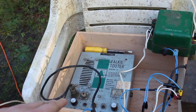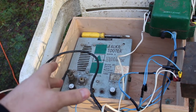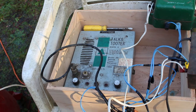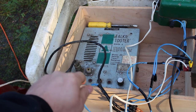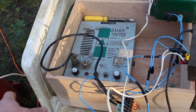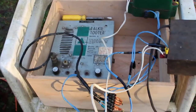And generally this yarder box is mounted just somewhere out of the way. In one of the yarders I ran, it was above me, mounted to a plywood board, had some rubber mounts on it so that if you ever got into a hard pull and things started to shake around a little bit, it wouldn't damage the electronics on the inside. And I ran one where it was mounted down to the side of my leg, to where you couldn't bump it when you got in the cab, that kind of a thing. So it doesn't really matter where it's at as long as it's accessible.